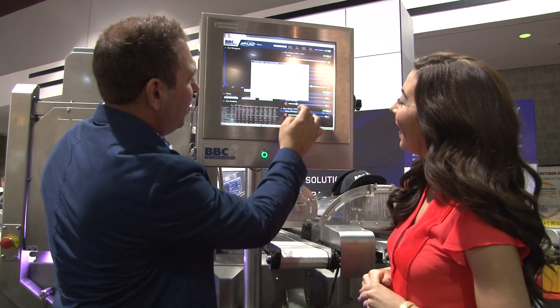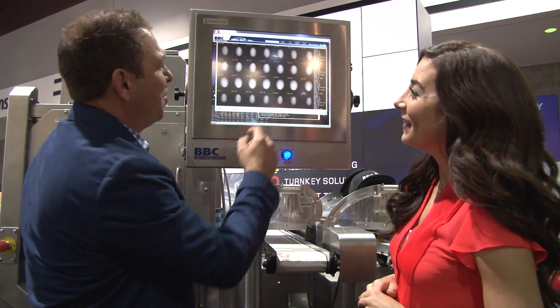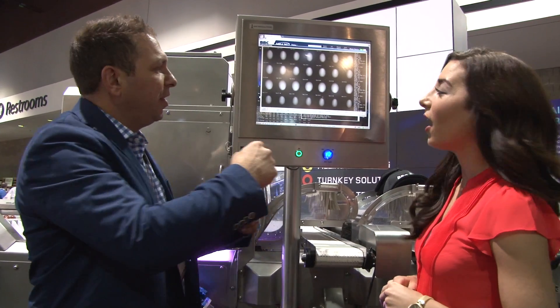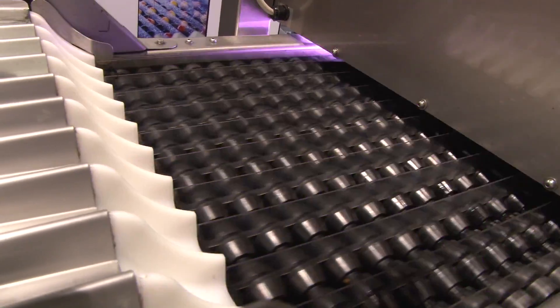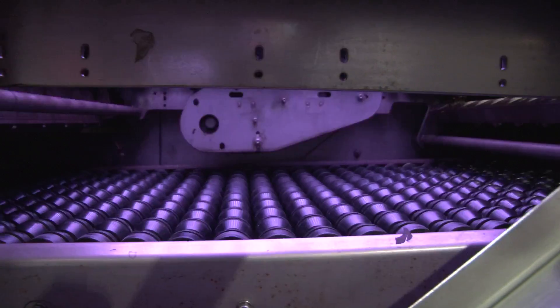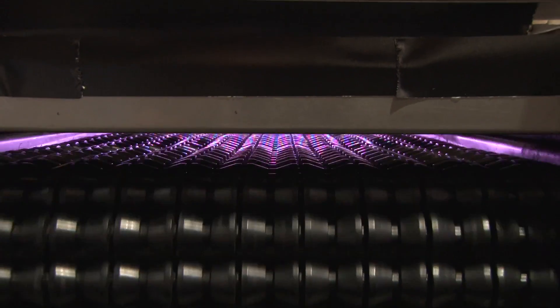So what are we doing right now? Right now we're looking at the rotation of the fruit. The fruit comes in here, it goes under the camera system. It's flashing 50 frames per second and able to diagnose color defects as well as sizing.